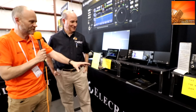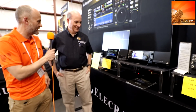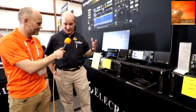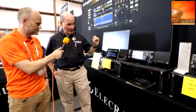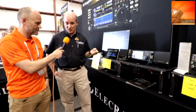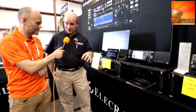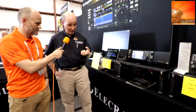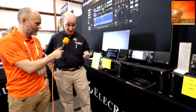And this looks like a very built-in radio. So you've got the pan-adapter, everything's in kind of one unit. Basically the K4 has obviously got a lot of DNA from the K3, our high-performance K3S course radios. But we combine the pan-adapter capability inside the radio, so no more second box with the P3 like we have with the K3. We are basically a direct sampling, digital signal processed radio. So we're direct sampling at the operating RF — so if you're on 20 meters at 14 megahertz, going directly down to baseband and DSP processing. All the filtering is done in the DSP on the core radio. There's no crystal filters to buy, and it's great performance at the core radio.